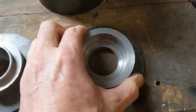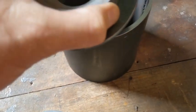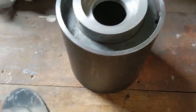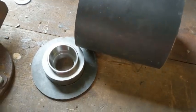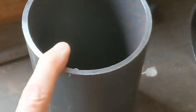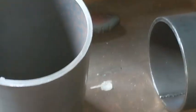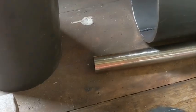So they're both done. There was the second one we just cut - needed a little bit of filing just to fit it in there. That'll just drop straight in down there, so that'll be the bearing support at one end, and then we'll put this one in at the other. So that's all done. The next bit we need to cut is two more circular plates to go inside this, which will hold this guy in place. It's the same outer diameter as what we've just cut, and I'll just measure up this again, then cut two identical plates that fit on this one.